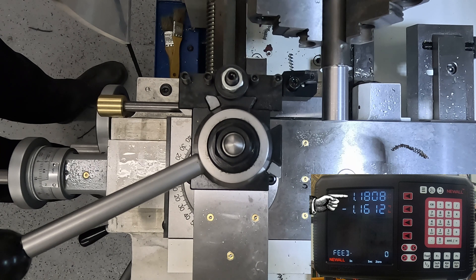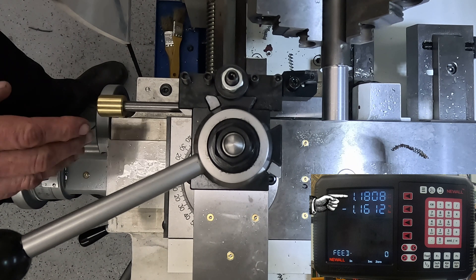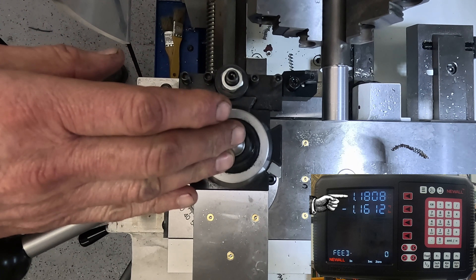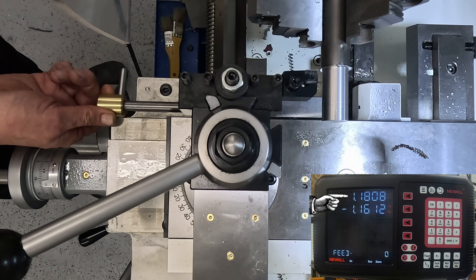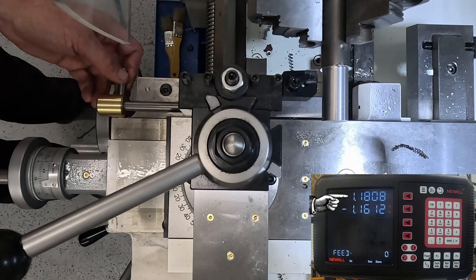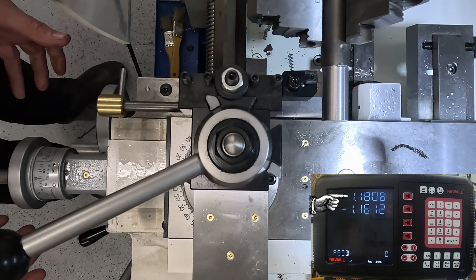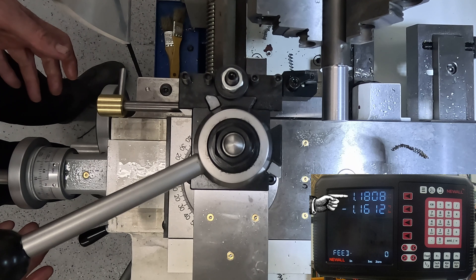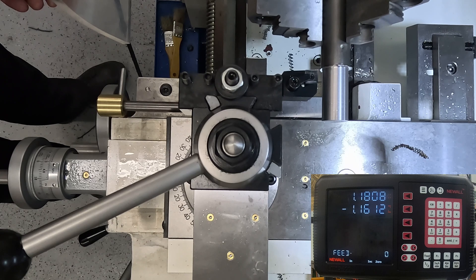So there you are — that's a demonstration of the whole point of the lock. Even at twice the depth of cut without the lock, the cross slide doesn't budge. So that's a win. And as you can see, to activate and deactivate the lock your hands are well back here, out of the way of everything that's going on. Very successful test, very successful modification.